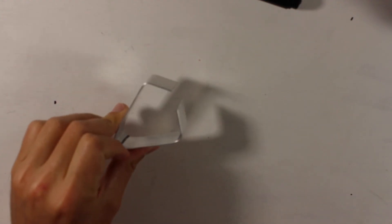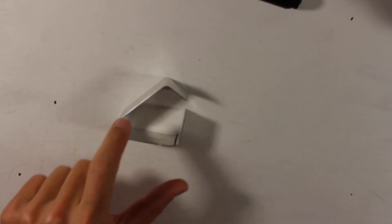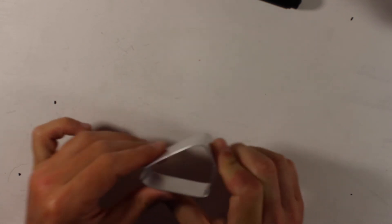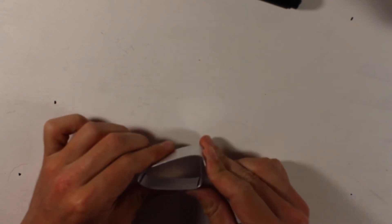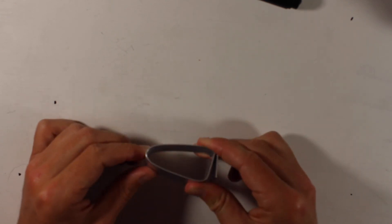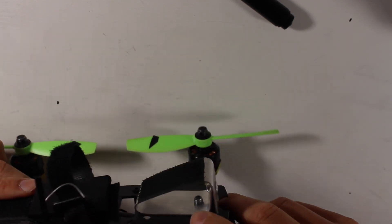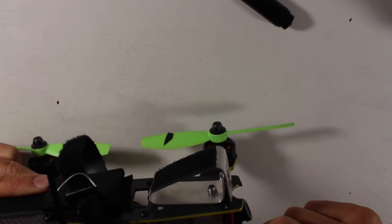Cut this up using tin snips and now I'm just going to fold all these little marks inwards. So I started to fold all these things together. One side, because it was about a centimetre longer, this one here is your hypotenuse — a little bit longer. With a little bit of force and a small hole for a pop rivet, you should have a nice Mobius mount. This is it finished on my ZMR — I put the little rivet in here to hold it together and bolted it straight onto the frame using a bolt, drilling a hole in the actual top of the ZMR.